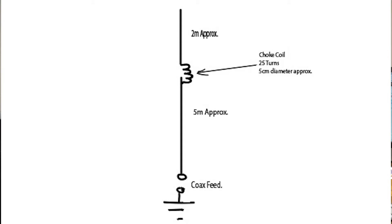I've used the spider pole to make this antenna. The good thing about the spider pole is that the coil you make will fit over the spider pole, so the spider pole is fed through the coil, which makes it a nice tidy arrangement. You can attach the wire to the spider pole whichever way you want — I've got a little screw in the top where I attach the wire, but you could tape it or whatever.